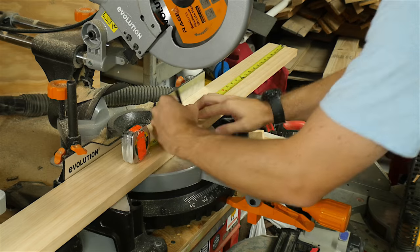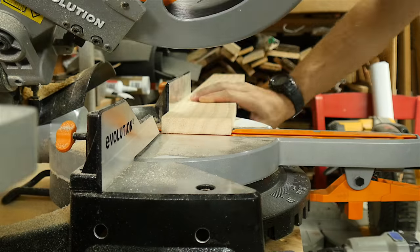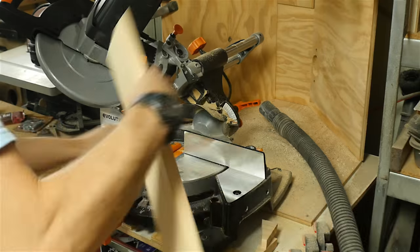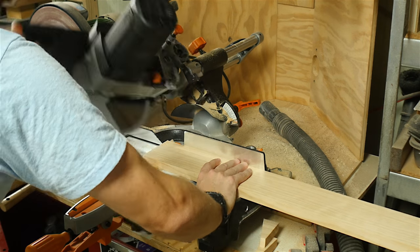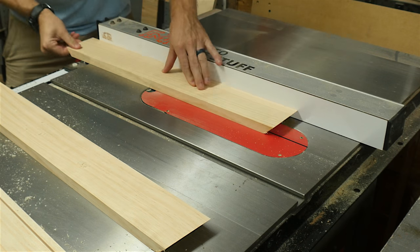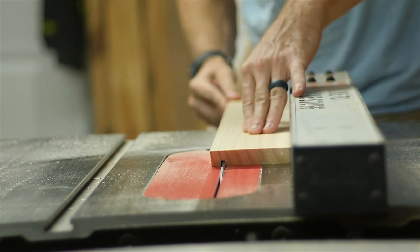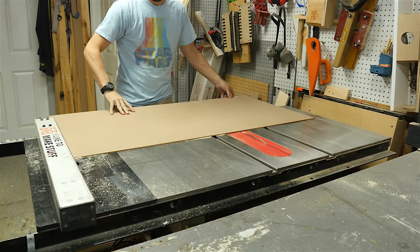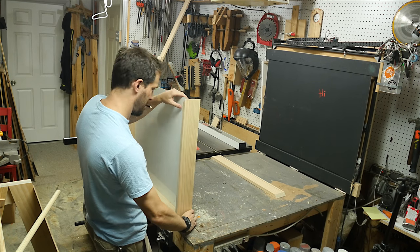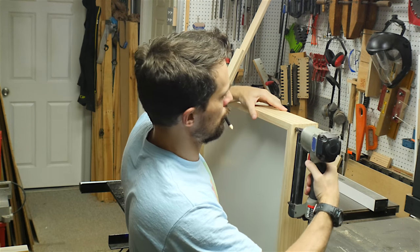The last thing to make was the tray that goes on the bottom — this is partially for support but also to hold the crayons, chalk, and whatever else you're drawing with. I rough cut the four sides just to make them easier to deal with, then went back and cut 45-degree miters on the ends of all four pieces. Getting these to fit together is really important, so take your time to make sure you have them turned the right direction and each side is the exact correct length. I lowered the blade on my table saw and cut a dado in the bottom of each piece to accept the bottom of the tray, then moved the fence just a little bit and widened the dado to accept the bottom panel. For that panel I used another piece of whiteboard material — it's nice and slick. I added glue onto the miters before putting the frame together but not in the dado, so the panel floats freely and can expand and contract. I held these together with some brads, although the glue will eventually do all the work once it dries.